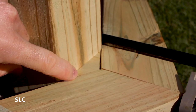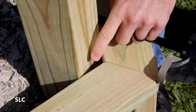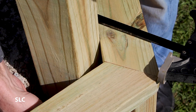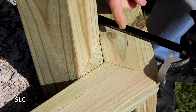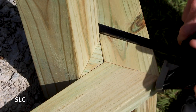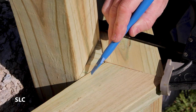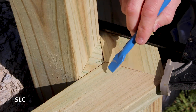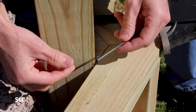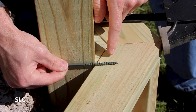Here's one of the triangles — I have one down in here and I should be able to glue that in place so I can have enough bite for the screw to go through. Remember when you're putting glue on end grain you've got to put a little on, wait a little bit, and put a little more because it soaks in quick. To try and prevent getting glue on the outer edge I'm going to install this from underneath. It's not perfect but just remember it is an outside fixture — it's going to flex a little bit with the temperature. I only put glue on the outer edge here, not against the main board, just in case I ever have to take it apart. Now to put a screw all the way through this 4x4 I'm going to need a really long one — I have a four-inch screw and I'm also going to inset it about an inch so I have as much bite into the outer frame as possible.